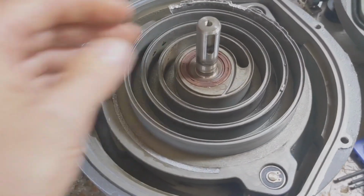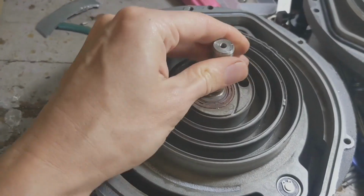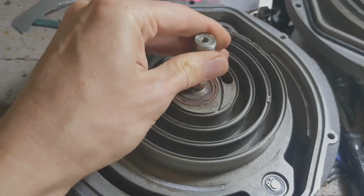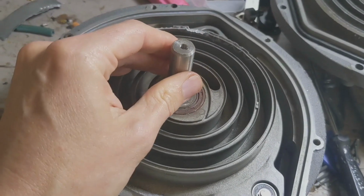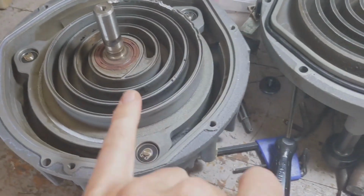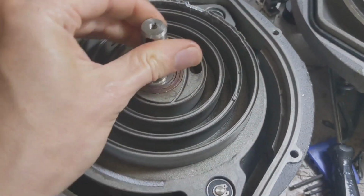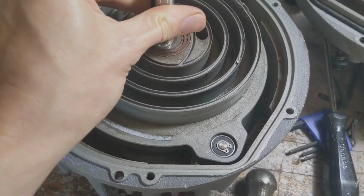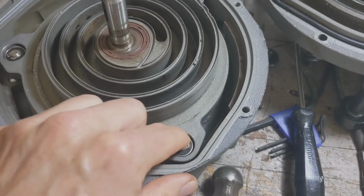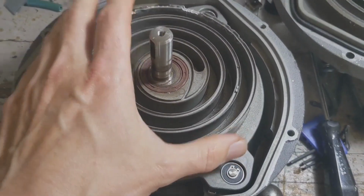And I didn't even know if this thing was still covered under warranty. It turns out it's a year and a half, and the warranty only lasts for 1 year. And guess what? The maintenance is due after 1 year, or 1 year of regular use anyways. It's 8,000 hours according to the manufacturer. That's just for the tip seals. The bearings are supposed to last longer than that. But whether this thing was a manufacturing defect is not the point. It's not under warranty anymore. And when that thing shattered, the balls that came out of that got eaten and just obliterated this whole thing. So this is scrap.